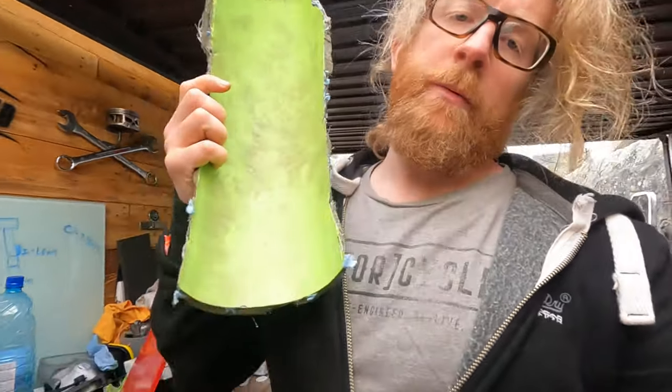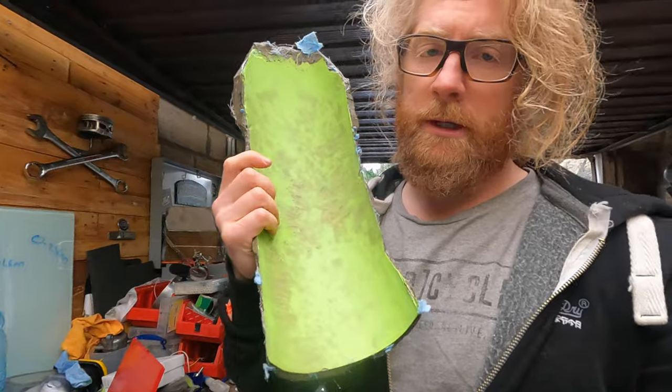So before I mentioned I was potentially going to make this out of carbon fibre, but my reservations about making it in carbon fibre are that your surface coat is exactly that, your appearance coat. I can't remember what they call it, but essentially epoxy carbon fiber is taken directly from the mold, so you want your mold to be as good as possible. Now, you kind of want that to be the case for fiberglass as well.